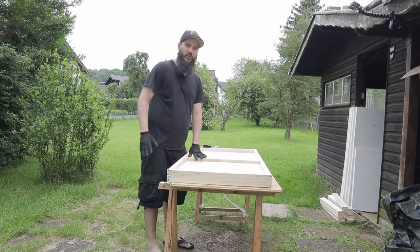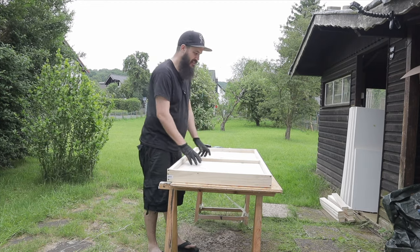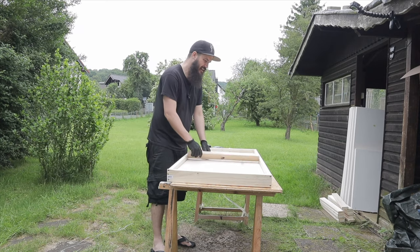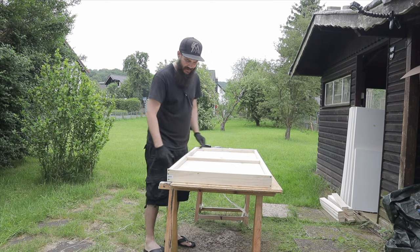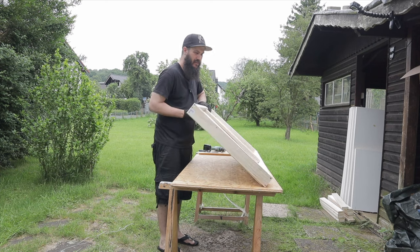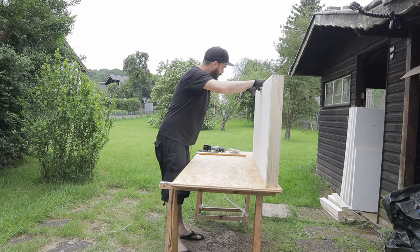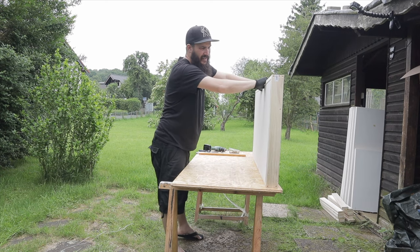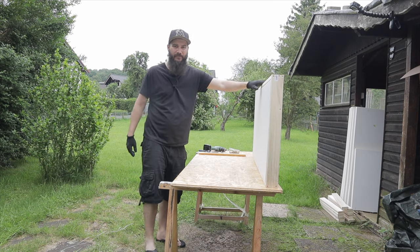One other thing that you can do in some cases when your insulation is not rigid and not solid is you can add some kind of backing support in the frame just to make it a bit more rigid, right? And bring everything together. So this is essentially one frame for our insulation sound panels. All you do is line all these things up, make sure that they're in there nice, and that's it. Now they're ready for some fabric. Let's get into it.